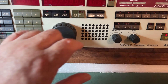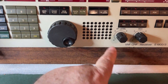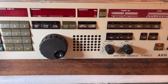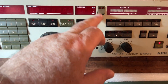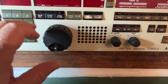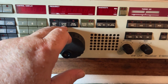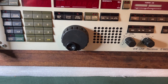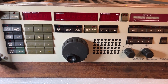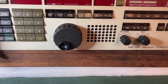So there's a control feature here, and the main RF sections. The built-in speaker is not too bad — quite good for its size. This is frequency selection and bandwidth — slow and fast. This is the memory recall and channel flag. You can set the settings under scanning for lots of different applications: pass, lockout, or hold for a certain number of seconds.